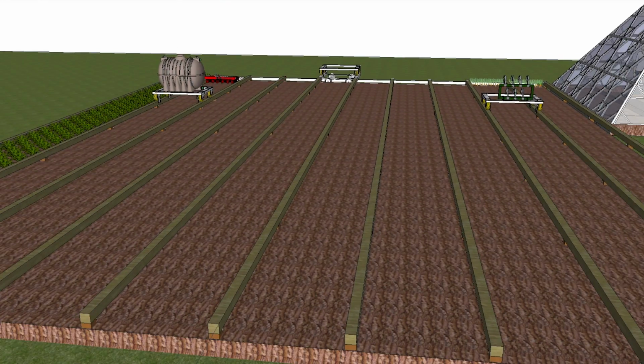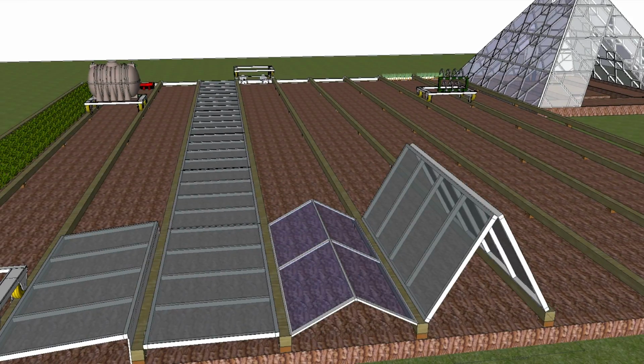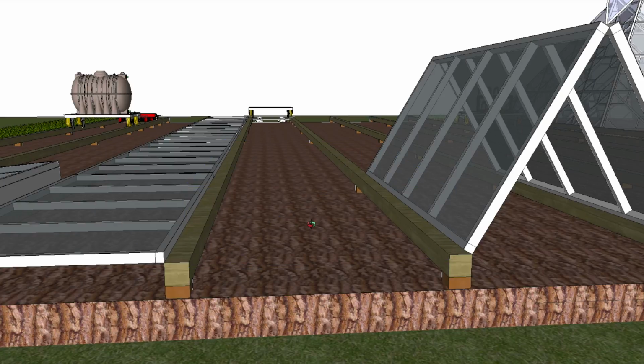So what I came up with was, here we go. I'll just get rid of this because we're not having this one anymore. What's wrong with this is it pushes out on the rails. So as you push a force down, the legs want to push out, and that could spread the rails if you had just one row, and maybe make them run out or something like that. So we're not doing that anymore.